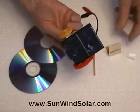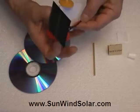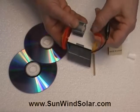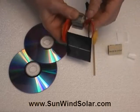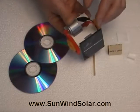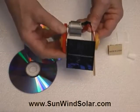Got that in place. Now we've got wires — you can come underneath to hook onto the motor. What I prefer to do is to tuck the wires under the solar panel, and then at this point we just use the alligator clips to clip onto the back of the motor. If you find that it's rolling in a direction you don't want, you can reverse the alligator clip test leads at the back of the motor and the motor will run backwards.